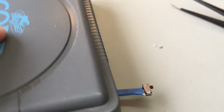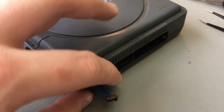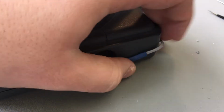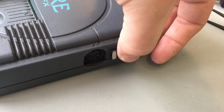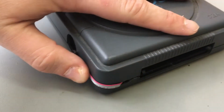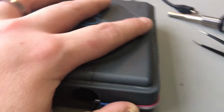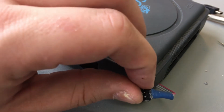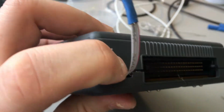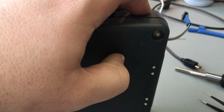So I realised something when I positioned the switch on the back, and you can see it poking out there, that if you did purchase the CD add-on, the switch will be inaccessible in this position. So what I've done is I've added some strain relief inside and a ribbon cable. So if you do buy the CD add-on, you can reposition the switch to the side like this, and then run the cable flat out of the hole like that. And there's enough room there that it would successfully dock back onto the CD unit. But for the most part, this switch will just be secured inside there. In order to release the switch, you just have to unscrew the screw, and then it gives you enough wiggle room between the upper and lower case to pull the switch out or put it back. So yeah, that's what I'm going to be doing on this model.